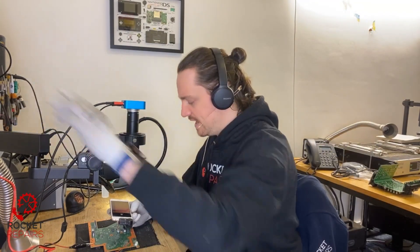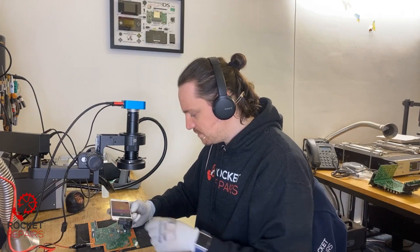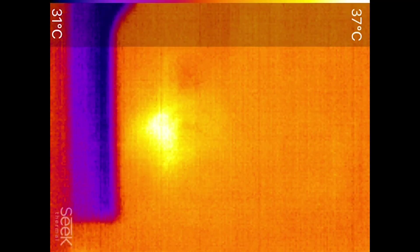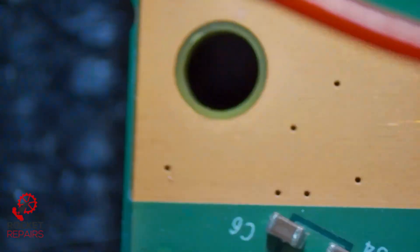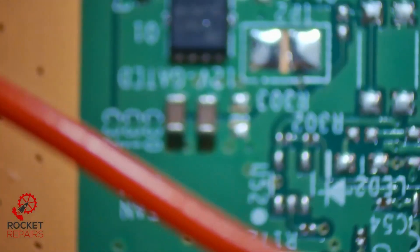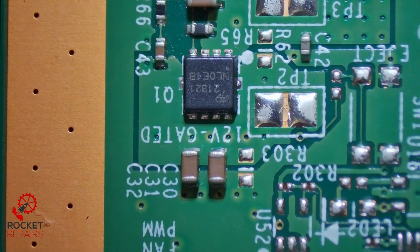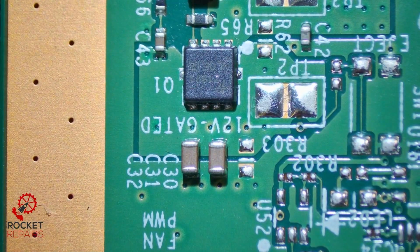Just because this is a 12 volt line doesn't mean you can go and directly inject 12 volts. I'm going to press the button now and we should see a little heat spot — we are currently drawing 0.5 volts at three amps. If I go over to the scope, I'll show you where on the board this is happening. We've got what seems to be a MOSFET along with two capacitors.